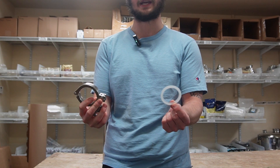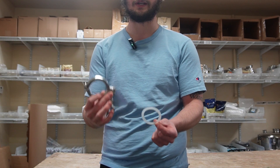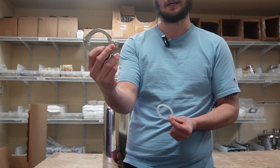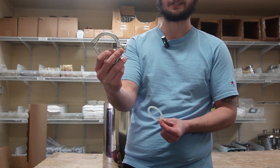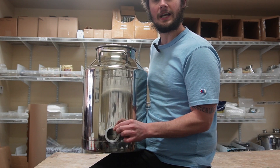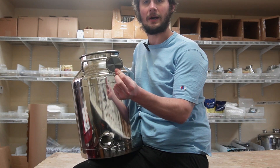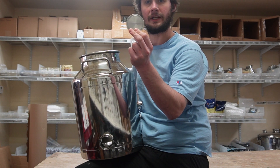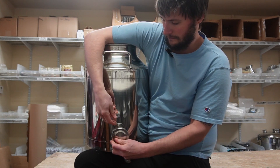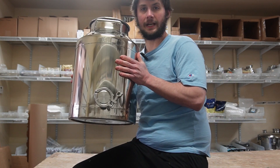The main way we set things up on our cans are these two pieces: a tri-clamp fitting and a tri-clamp gasket. The gasket helps the seal, and the tri-clamp puts the joints together and makes sure nothing is wobbly or loose. We place the gasket right on this flanged port — it should fall right into the groove. What comes stock in every Mile High can is this cap right here to cap you off, for use with propane or a hot plate. Then we just clamp right there to handle this port.